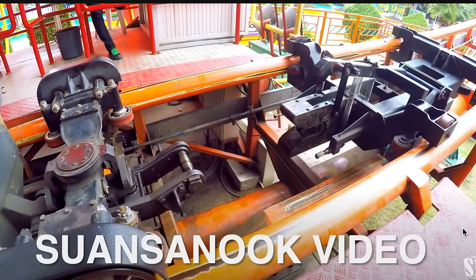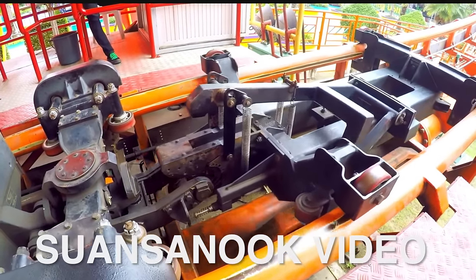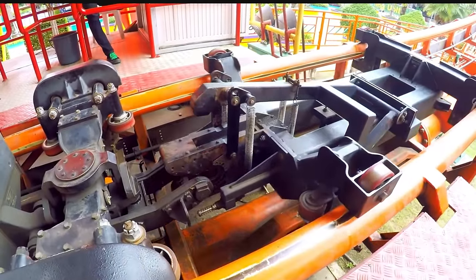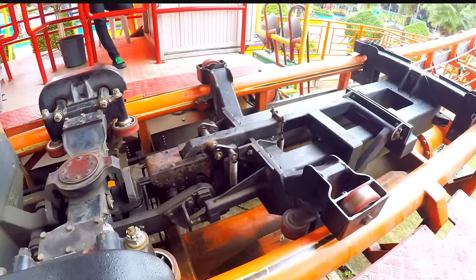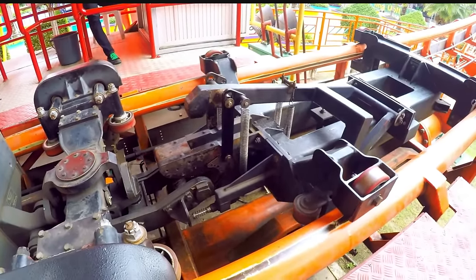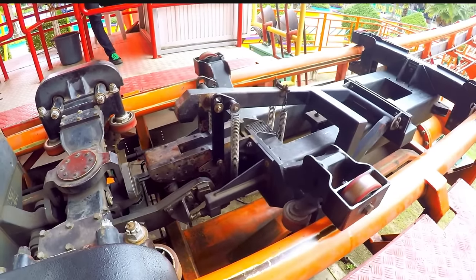It was like, all right, you can replace parts during the season, one part at a time. That way, if you put that one part in and the thing doesn't work again, you know what one part to tackle now, right? It's like, okay, I know I did that one part, so I'm going to go back into that one part and figure out what happened in there, because that thing's complex to work on. You'd think there would be a bunch of ball bearings inside or something that would help everything rotate smoothly, but nope. It's all just brass on steel with just a thin layer of oil coating it to help it work. It's quite touchy.